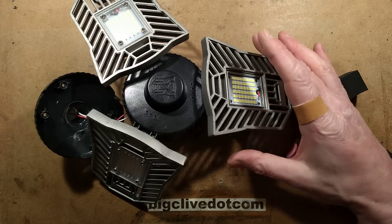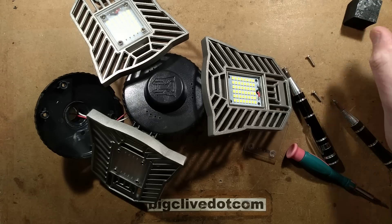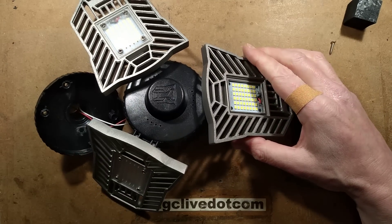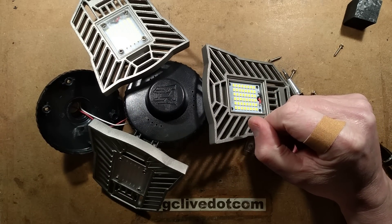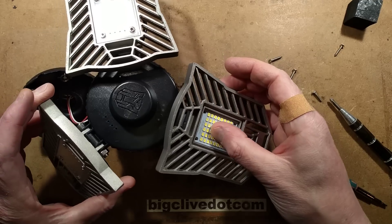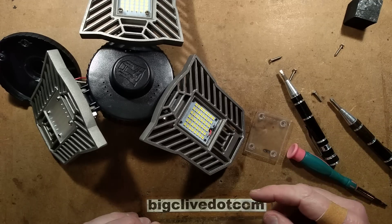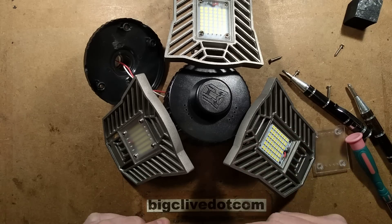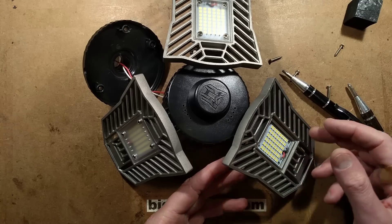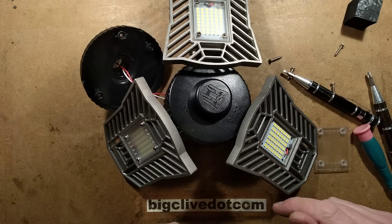When smart meters start charging for apparent power, it's going to suddenly cost twice as much to run — almost as much as a 100-watt tungsten lamp. The aluminium housings are quite nice; it'll be interesting to see what temperature they get up to, and it feels quite robust. It's quite focusable, so so far it's actually quite neat and very stylish. I'm going to do the tests now and I'll leave the results of some thermal tests — both of the internal power supply and the LED panels themselves — in the description below, along with how they're dissipating heat into the heat sinks, so we can maybe assess from the temperature how long we expect these to last.